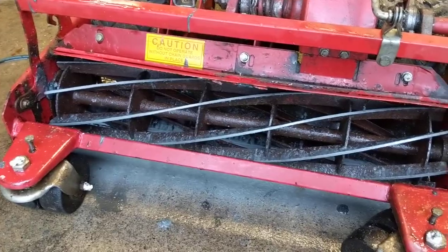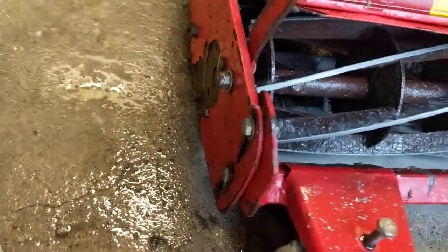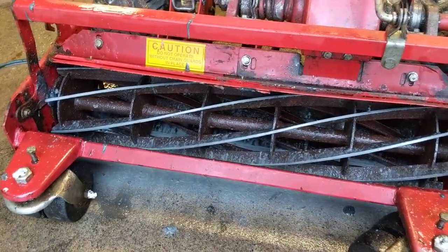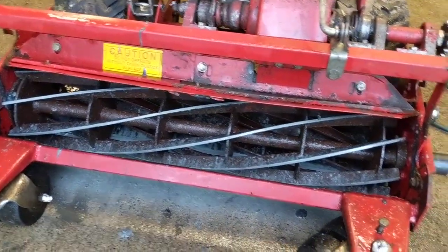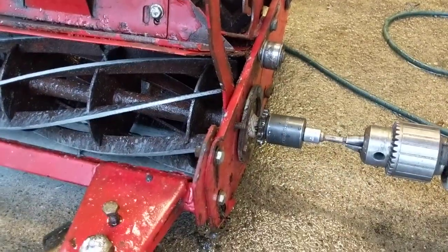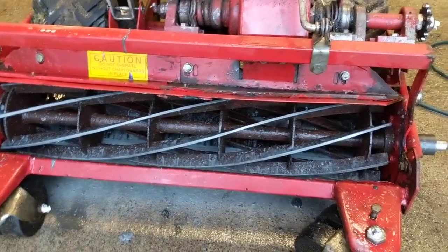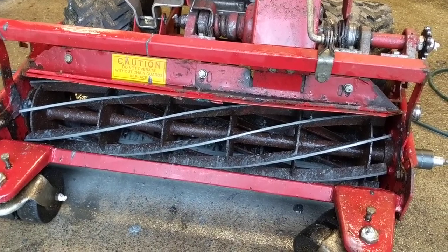So basically back lap it, back lap it, back lap it, and when you're done tighten down the end bolts on each side, do your paper cut test with some newspaper and you'll find this thing will cut just like the day you brought it home from the lawnmower store. That's a real quick TrueCut sharpening video guys. I'll probably do an in-depth one on how to do the chain removal and actually show the top setup of the cams. But for now it's something to get you back lapping just in case you want to do this before the season really gets going. Thanks for watching.